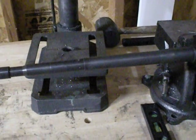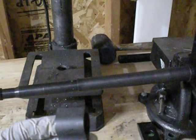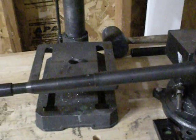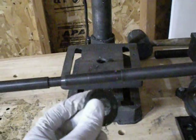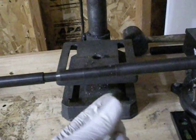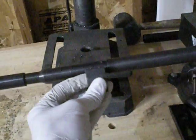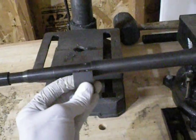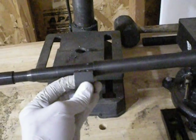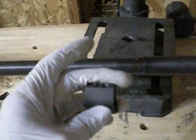Go nice and slow. I can't stress enough how important it is to make sure that you've got your gas block oriented in the right direction so that you don't drill the hole too far forward. Another thing is when you're lining it up, the thickness of this handguard retaining plate — I forget what it's called exactly — it's about 30 thousandths thick. What I'll usually do is set it back from the shoulder about 30 thousandths. You can get away with ramming it right up to it, but to be in the technically correct place, you'd want to space it out about 30 thousandths from the shoulder of the barrel before you drill.